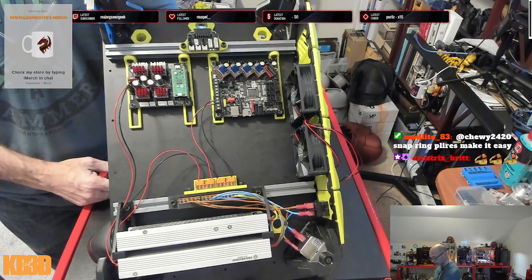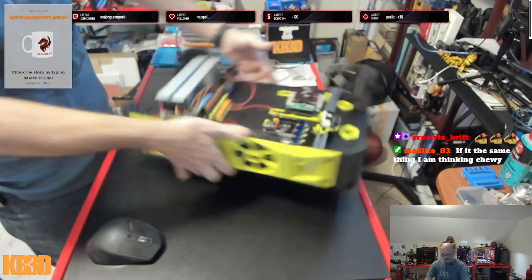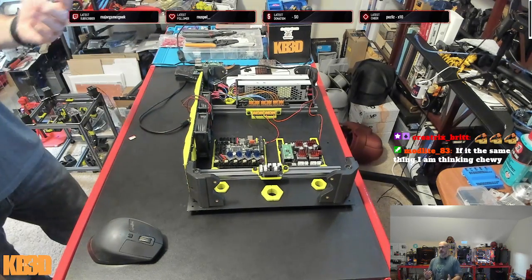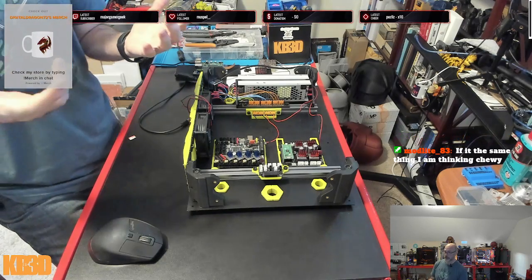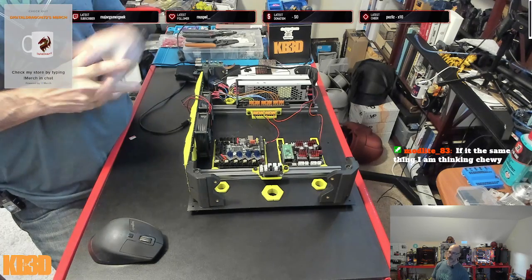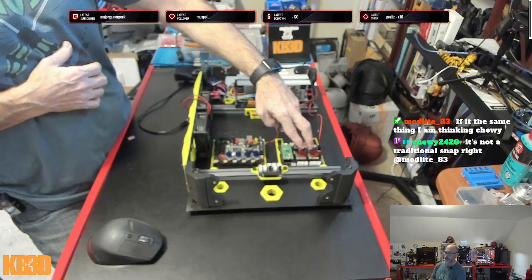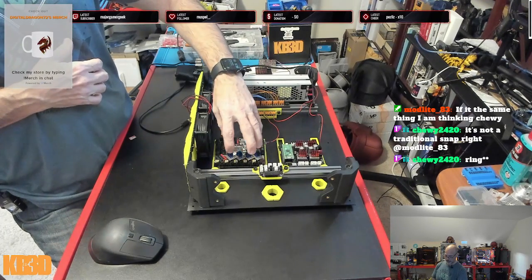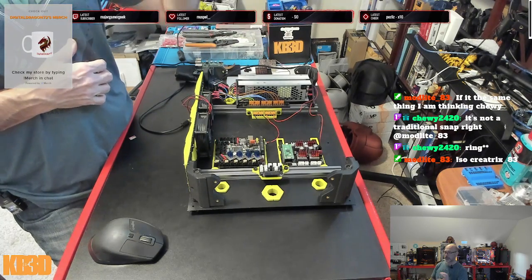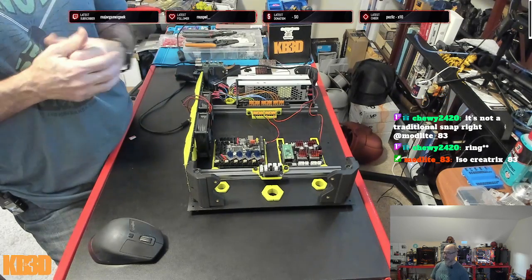So that's kind of where we're at. I also started playing with a printer configuration file. There is a generic printer configuration file out there by Annex Engineering. They also have files specific for the pinouts on a Constellation board. Then I grabbed the BigTreeTech file for this, left all the pins in there, and copy and pasted the rest of the information. So I think we've got a decent-ish basic config going.